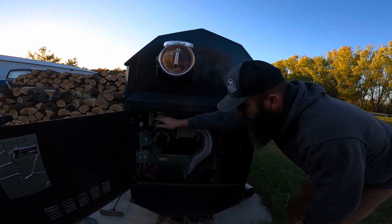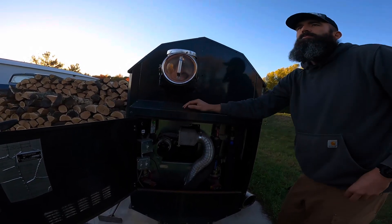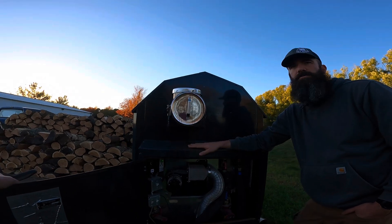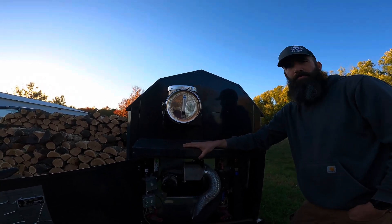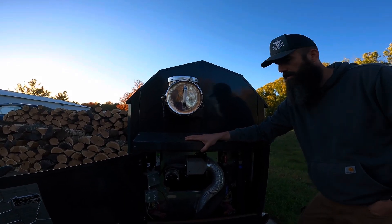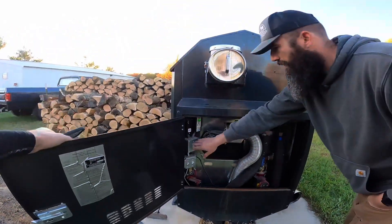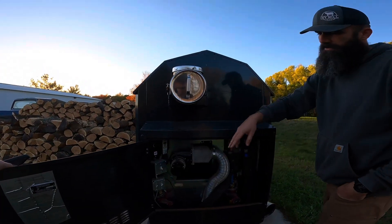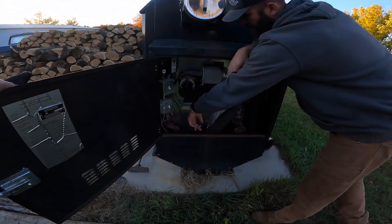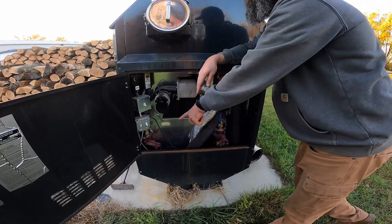The digital control lets you adjust your set points. Right now I run mine at 175 cut-out and 170 cut-in - just a five-degree water differential. The stove just maintains that; it doesn't care what's happening in the house. High load it'll cycle more, low load it'll just sit and smolder. I also added a custom shutoff box so each pump can be isolated - if I need to change one in winter, I can shut it down while the other pump keeps circulating.